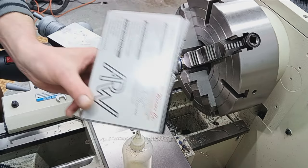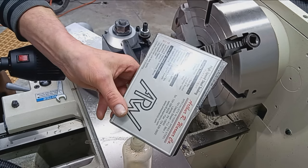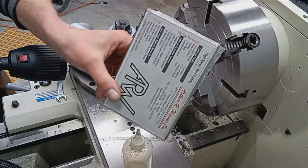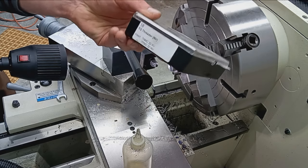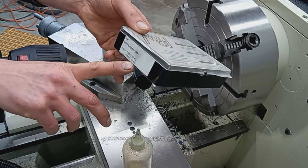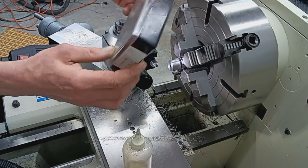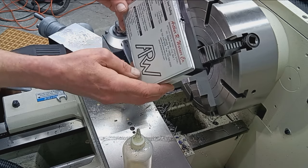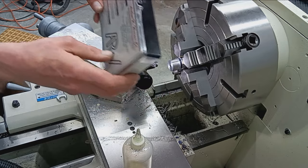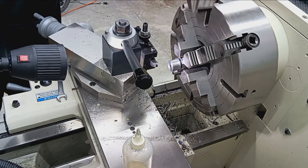This one's there. Half inch holder, NV threader. Kit number 18. I believe they still sell these, but they fit these inserts. So you can do all the way up to a 32 TPI thread if you needed to. I can't remember what NV stands for offhand. I should probably know that, but it's slipping my mind right now. But anyway, these are made out of T15 high-speed steel, I believe. Last time I checked, it was at least. So that's the threading tool we got here.